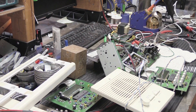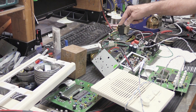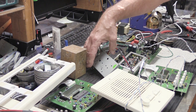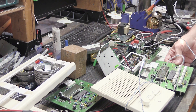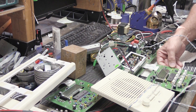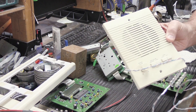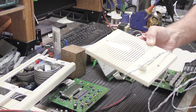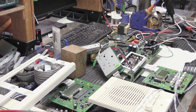What I did yesterday was substitute a good transformer — one belonging to me — for his damaged one. I substituted another tuner module to sort of bypass his. I looked through the boards I have and found another microprocessor board from an MC302 — this one belongs to me, soon to belong to Tyson — and substituted it in. I sort of Frankensteined it all together with my remote station and hooked an antenna to it.